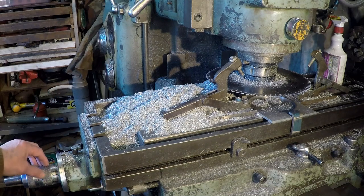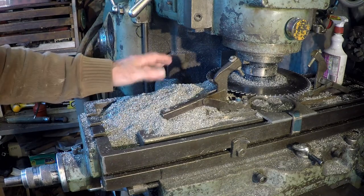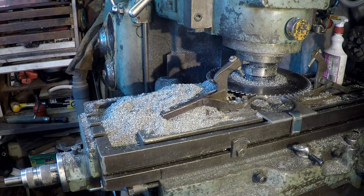The metal I got anyway was pretty junky — still pretty full of oxide. I used it for some non-critical castings, some of my own moulding boxes from memory. It would have been weak, porous, and generally not good stuff. So my advice to anyone is don't melt this crap down. It's contaminated with WD-40 as well. Terrible stuff.